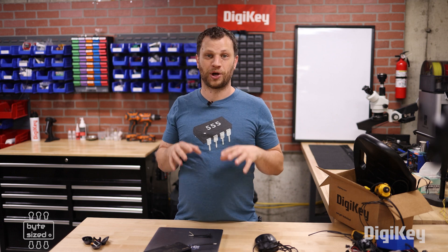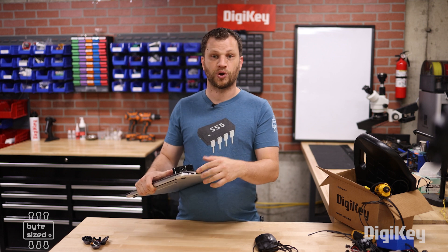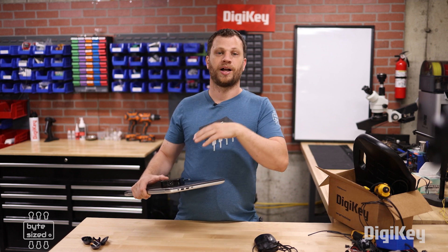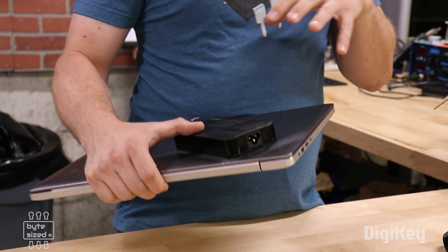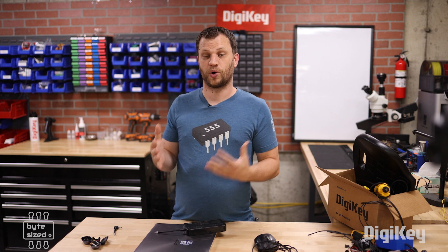As an engineer, I'm going to try to open this up and fix it. And that's exactly what I did with this laptop. All of a sudden it wouldn't take a charge, so I tried a few things and I thought it was the charging port on the side. So I got my tools out, stripped it down, opened it up and looked at the circuit board. Once I decided the charging connector was the problem, I ordered the replacement part, waited for it to come, got out the soldering iron, desoldered the old connector off the circuit board, put the new connector on — and it didn't work.